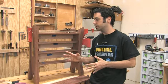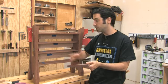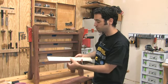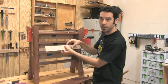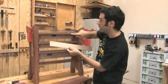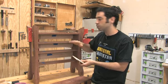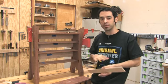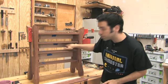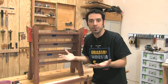I've jumped ahead a little bit and we've got a dry assembly going. You can see the shelves have already been cut and are in place — just half-inch bubinga stock milled down to the proper width and length to fit perfectly between the two sides. The back panel strips are also in place now and you can sort of see how this is going to work. The little skinny strips are going to be cut in half with a little extra material removed from the center, then they go into the rabbet and all the way into the groove on the side and lock in place. The end is going to be held into that rabbet with a rare earth magnet, so just with your finger you can pull the little strip out of the way and run your wires.